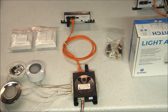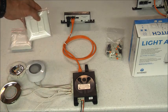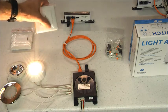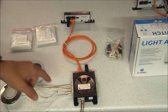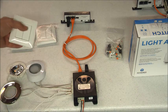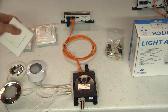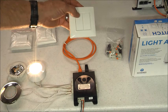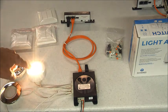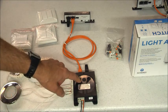Moving on to channel 3 — I'm a bit short on switches here, so I'm going to set the top rocker as both on and off. It had no problem with that, leaving me with the bottom rocker free. To demonstrate three-way switching — where you turn the light on when entering a room and off from another location without walking back — I program that bottom rocker as an additional on/off for the same channel. Now I have two switches associated with that channel, with one switch still left over.